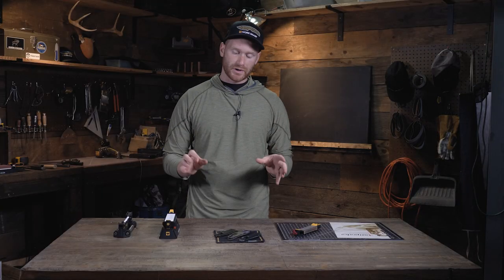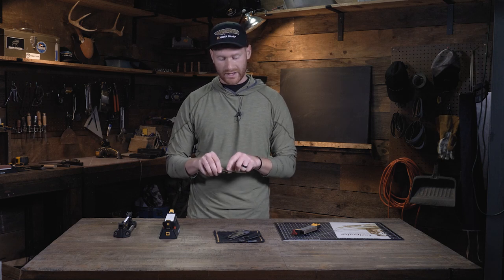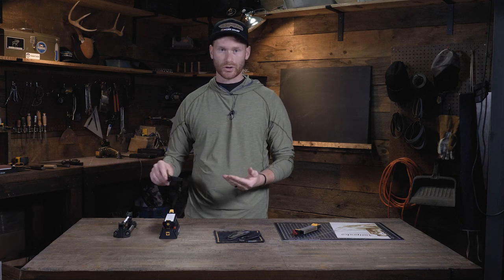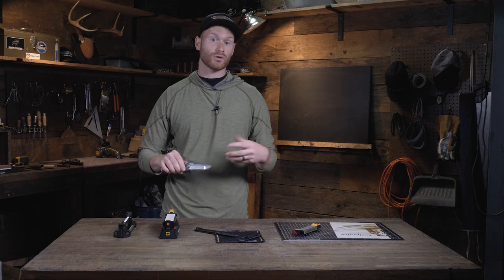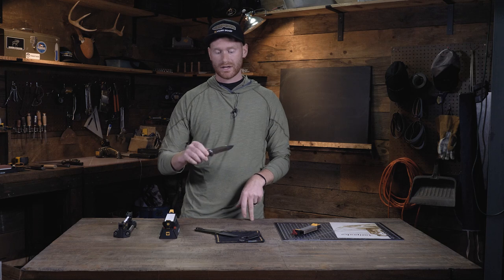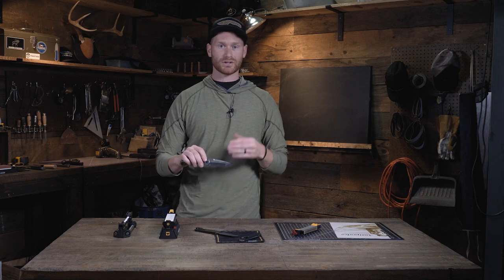Wow. Just remember, when you're sharpening a Tanto, there's a couple of things to keep in mind. Sharpening is the same as any other knife with the exception of the transition point. Make sure you stop on the transition point and treat each edge as its own knife. That could mean that there's two different angles, two different shapes or profiles. On this Bailout, they're both flat or straight edges, so you can sharpen those on most types of sharpeners. On the Vector, there's a recurve section and a radius section. On a recurve section, or with any recurve knife, use a rounded abrasive, something like a ceramic rod, or the Spyderco SharpMaker has those triangle rods. You can use the edges of those to sharpen inside of a recurve as well. Again, treat those as two separate blades and make sure you line up that transition point with the place that you're stopping and transitioning your sharpening.